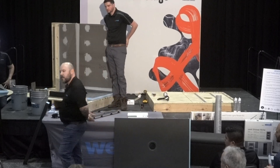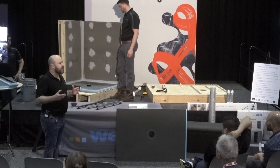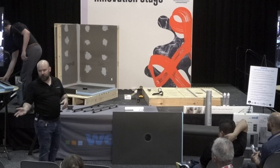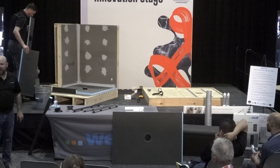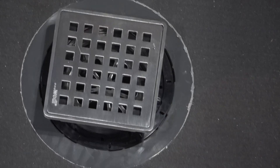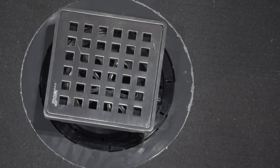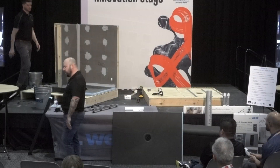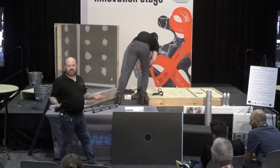For our linear drain shower bases, you have a lot of options. This is a single slope 32-inch or 48-inch. We also have four-way slope linear drains in many sizes: 48, 72, 32 by 72, and your typical sizes like 32 by 60 and 36 by 60 tub replacements. One of the main reasons a lot of people use Wedi is how versatile and customizable it is. You can cut down shower bases and extend them with extension panels — we make it easy to put material lists and projects together.